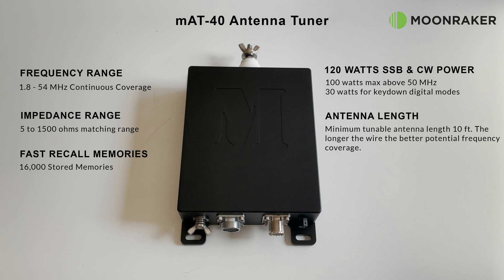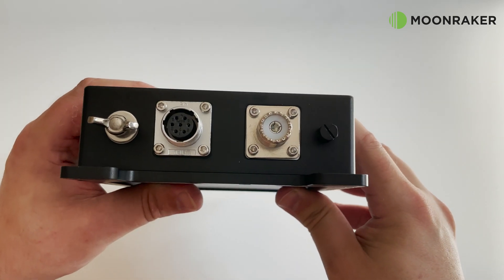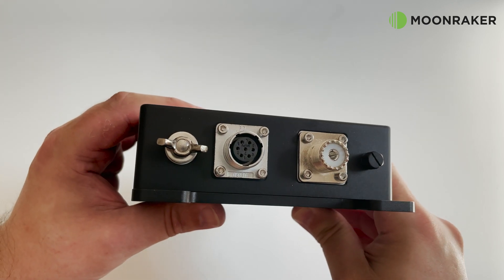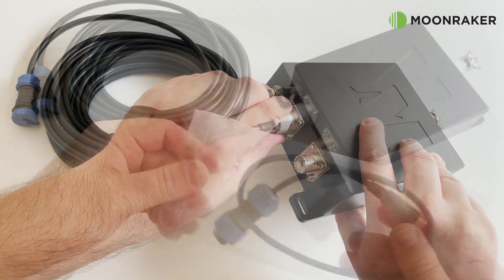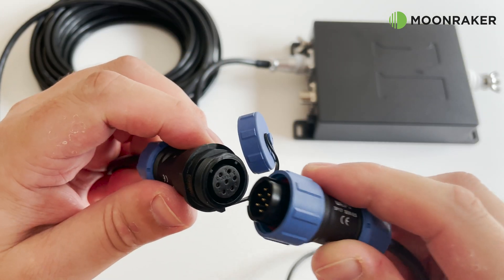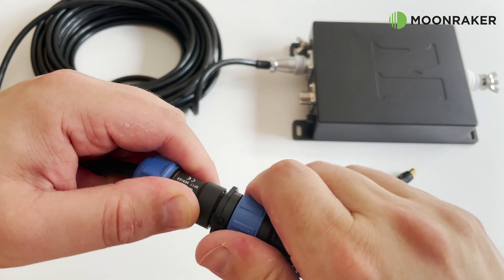Recommended lengths would be 12 meters or more. On the rear of the MAT 40 we find a single wingnut connector for connecting your antenna wire. On the other side you'll find an earth wingnut, an SO-239 for your coax feeder, and a connection for the supplied 10-meter control cable to either Icom, Kenwood, or Yaesu transceivers. The only extra part you'll need to purchase is the adapter for your specific model of radio. The control cable and radio adapter cables come with easy-fitting waterproof connectors to protect against the weather all year round.